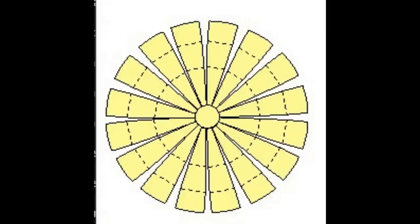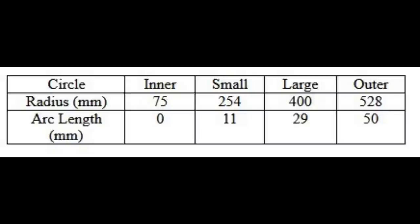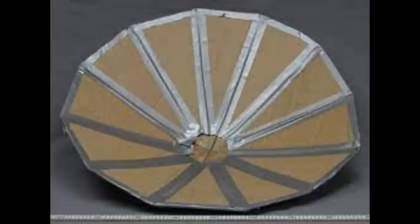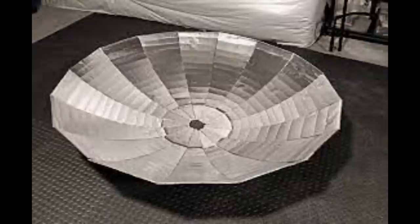With those four circles drawn, you cut the shape out like the petals of a flower and fold them up. The amount to cut from each petal depends on the radius: at R1 nothing is cut; at R2 the cut is 11mm from the line; at R3 it's 29mm; and at R4 it's 50mm. You get a beautiful petal shape — cut down one edge, then fold up along the dotted bend lines to form your parabola.